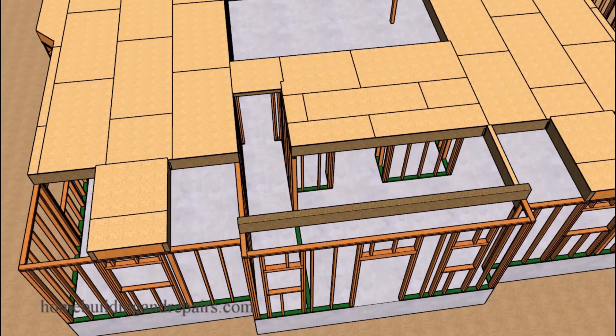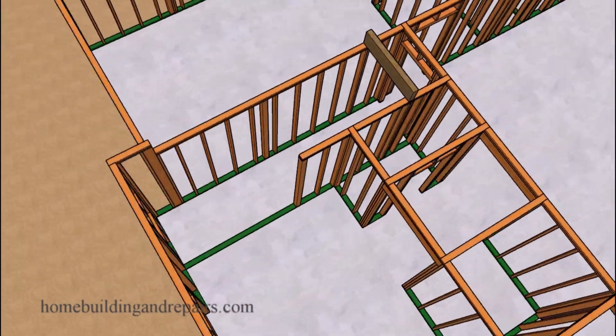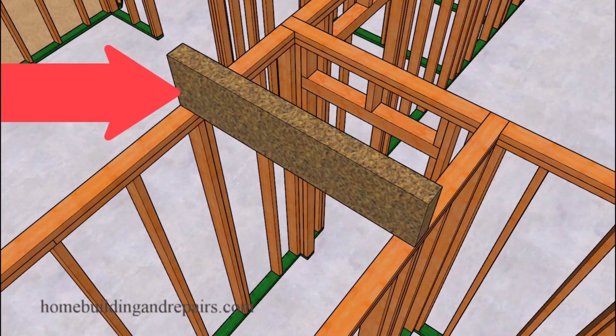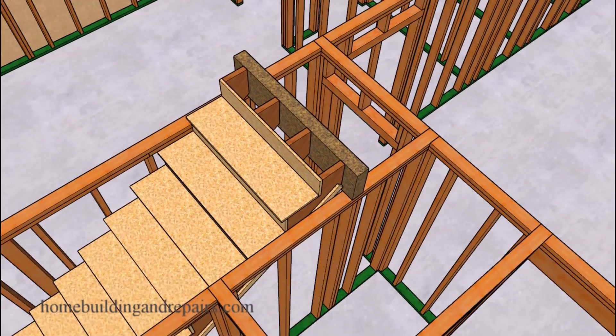Next up, let's take a look at a different house where you will have another situation that could save you a lot of frustration as a do-it-yourselfer or even a professional home builder. The situation I see all the time, whether I'm working on a project or driving by one, is that they will build the floor first and then install the stairway. I'm here to tell you that you need to build the stairs first to locate the stair head out and then build the floor if possible. If not, it wouldn't be a bad idea to pre-cut your stair stringers to verify the measurements for your head out before you build the floor.